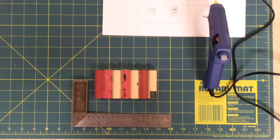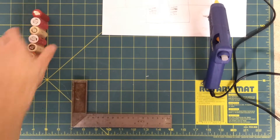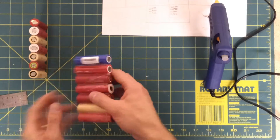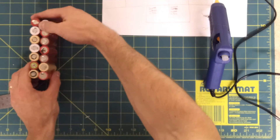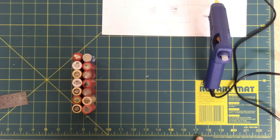Now's the time to put them all together. Next stage, we'll be soldering them. I'll just be using copper wire to solder them all in parallel first of all, and I'll do the series solders later. I've yet to buy a BMS — I need two of them, as it's got two packs. And I need a voltage monitor as well — I want to know when the pack is getting too low, when I'm hammering it on the bike doing about 90 miles an hour. This is what the pack will look like: positive upwards in parallel, then series with positive downwards, bridging across repeatedly for 13 wide.